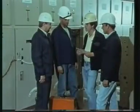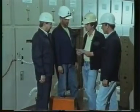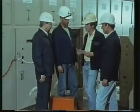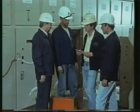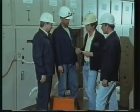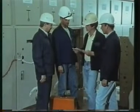Right lads — where your work site has been completely disconnected, secured against reconnection, it's been verified that the installation is dead, and it's all earthed and short circuited. And rule five: provide protection against adjacent live parts. Protection has been provided by means of a safety chain.